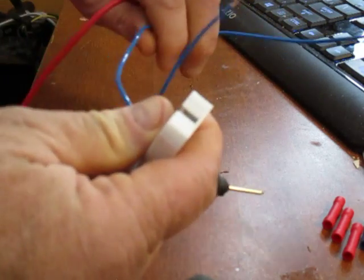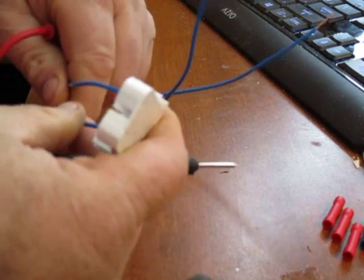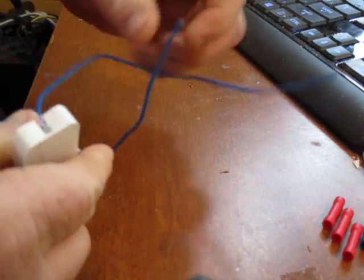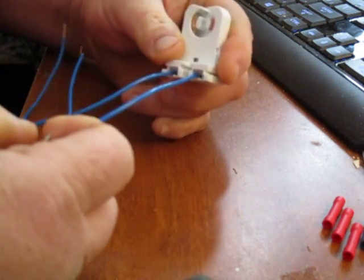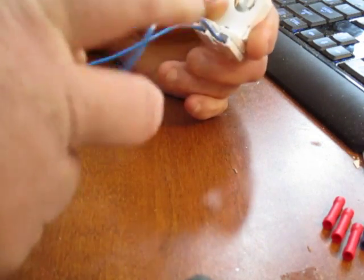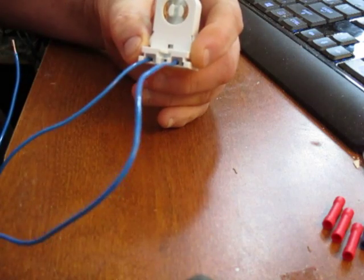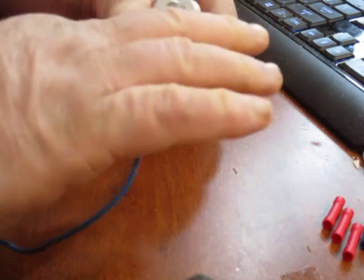One side is going to be your power and the other side is going to be your neutral. If you have two lamps in your fixture, you're going to hook — you're going to be consistent — either the left one or the right one as power. It helps troubleshooting a whole lot better. Each left one in the array is going to be power, and the other side is going to be neutral.